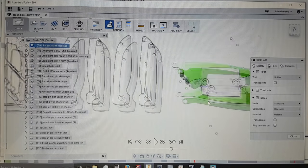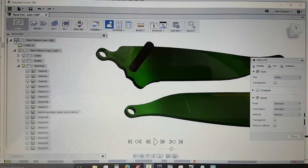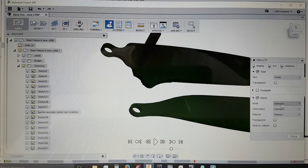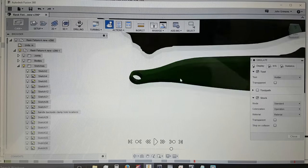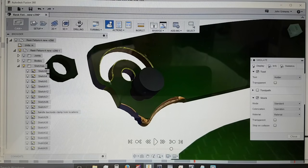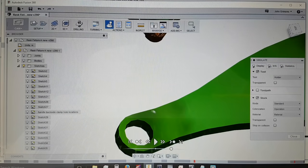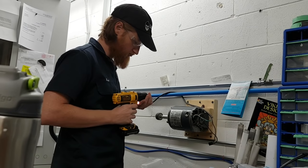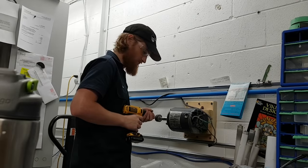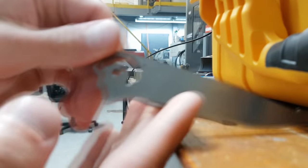Let's do a quick simulate. When I simulate, I like to hide everything — scroll all the way up — so that there's nothing left, turn on the stock, turn off the toolpath, and this is how I like to do it. I just click to the end. So that's what it's doing — it's got a corner rounder coming in here. The corner rounder is actually going to buzz this a little bit on purpose; Eric requested that, and we'll look at it and see how it goes. There's the smile. That's the one. So here is the blade, which has already been machined, like what we just did in CAM.